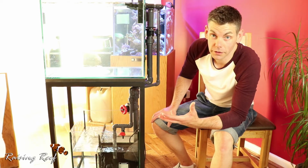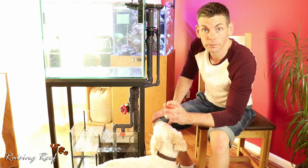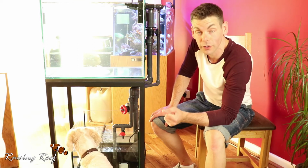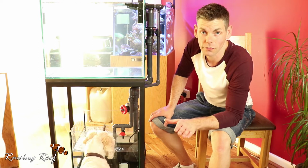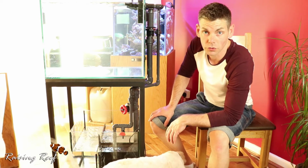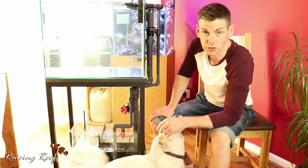I must say that I'm loving the gate valve. It makes adjusting and fine-tuning those water flows really easy. I've never used one before. Previously I've always used a ball valve, and I've had an absolute mare trying to make those fine adjustments. This is just so much easier and worth every penny of the extra cost it takes to put a gate valve onto your system, and I highly recommend that you find that extra money to do so on your system. It just makes so much difference.